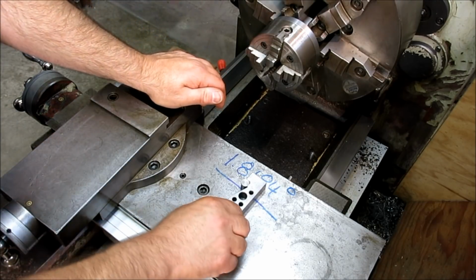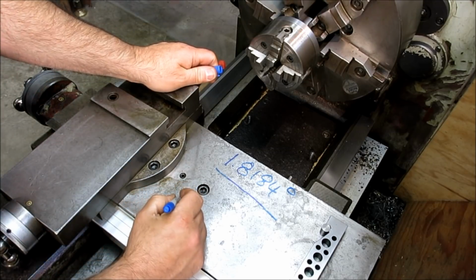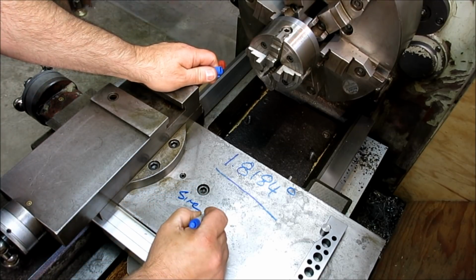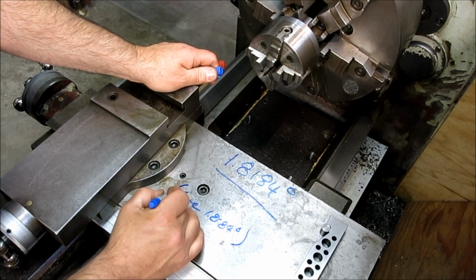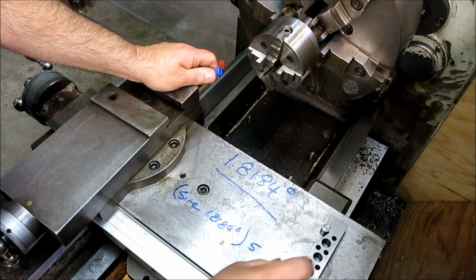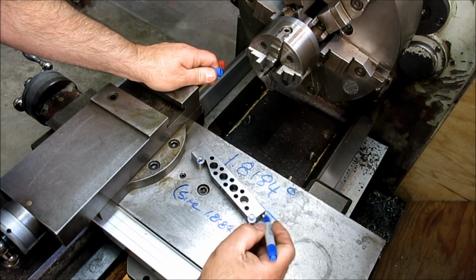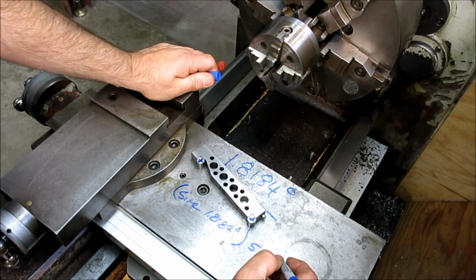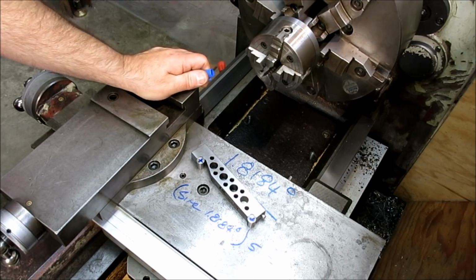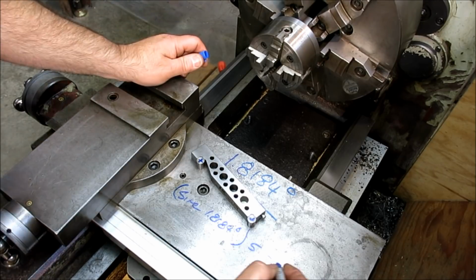Okay. So first we need to set this angle. So we need to take the sine of that angle, 84 degrees. Okay. And then we're going to multiply that result by 5. Okay, which is the center distance from here to here. Okay, that's 5 inches. And then what that is going to give us is it's going to give us a number. Okay, and I think I have it here. I already did it.